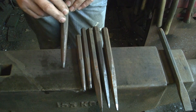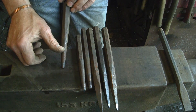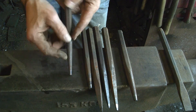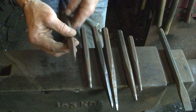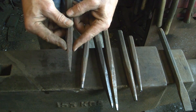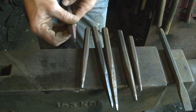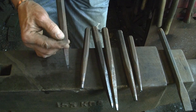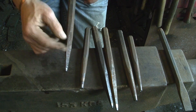They're fairly resilient, these Allen keys, but you need to make your punch with quite a bit of meat in the bottom. It's difficult to describe what you need - most of mine are going through fairly thin material, so they don't need to be particularly chunky. Like these pritchells - they're going through a very thin piece of metal at the bottom, so it doesn't really matter about the taper. It's the very end here that's just punching out a tiny little rectangle.